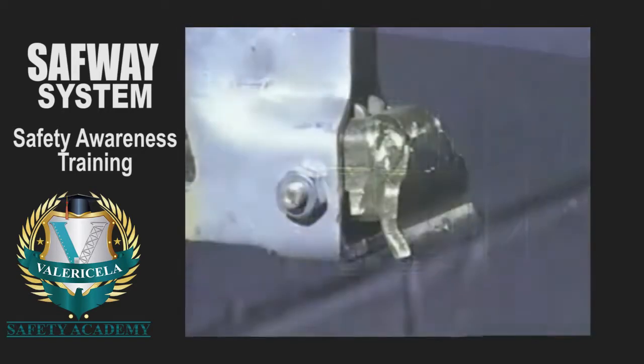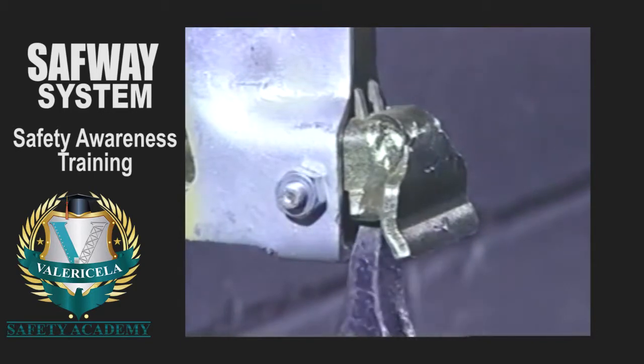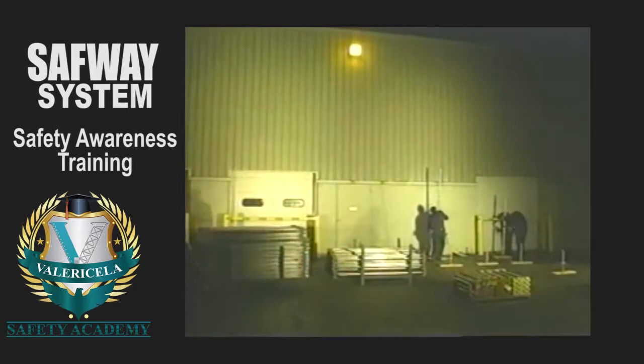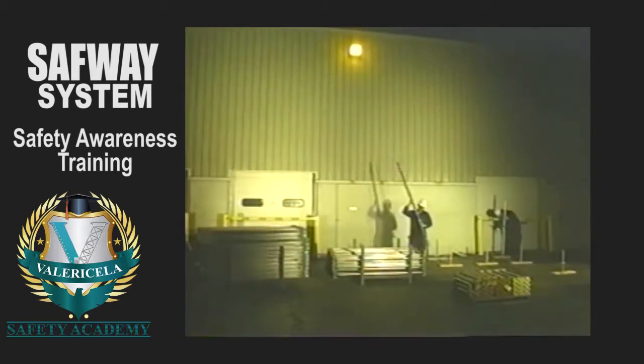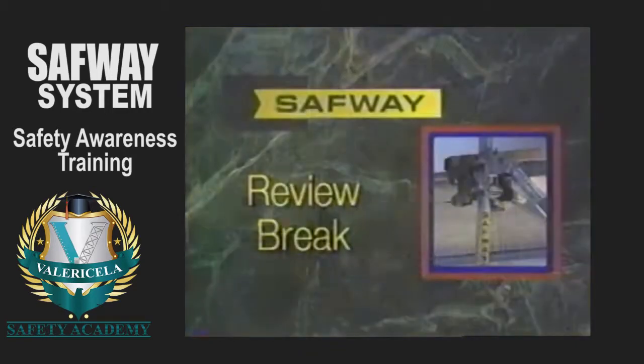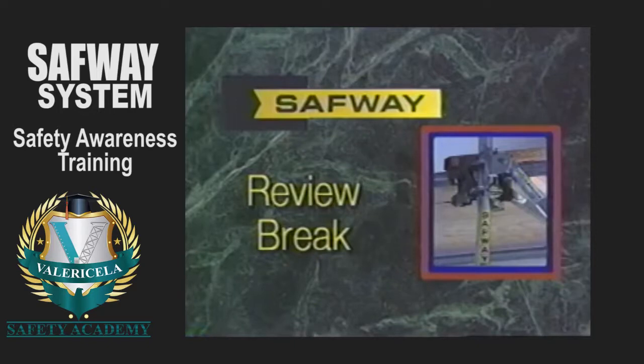When releasing wedges, insert, lift the retainer, pry, and pull. Do not remove ties until the scaffold has been dismantled to that level. Dismantling is now completed. We'll be back with a conclusion in just a few moments.